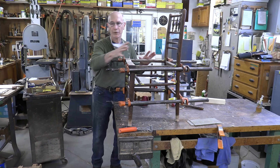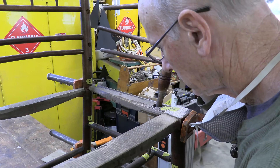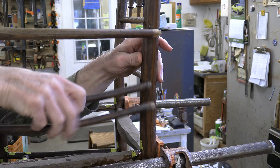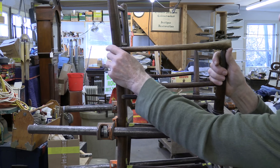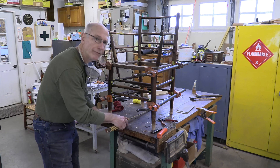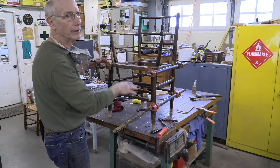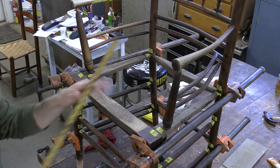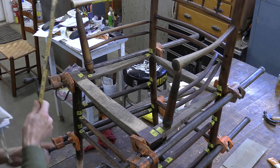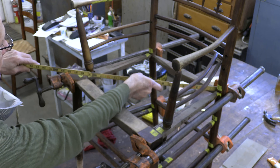I'm not going to glue the arms yet, but I need to put them on to make sure everything lines up. I can see this is going to be tough to do when I glue these on, but everything looks like it lines up. I'm about a half inch out here — I'll put a diagonal in to see if it wants to come in a little bit, but I'm not going to worry about it too much, it seems to be sitting fine. Now I realize what I should really be worried about is if the seat is square. It's only an eighth inch out, which is close enough. I'm just going to leave this alone.